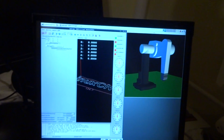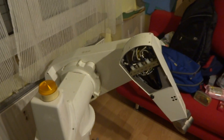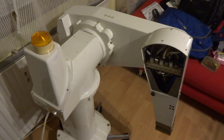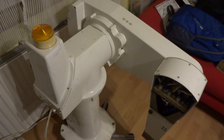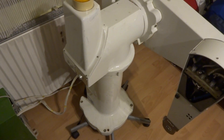This is how the new Arduino-based homing for the Puma robot works. Let's start the homing procedure. In the base of the robot, there's an Arduino Nano that's connected to the six analog inputs from the potis and the six digital inputs from the encoder signals — index signals of the encoder. There's software in the Arduino that simulates the home switches on the Linux CNC.